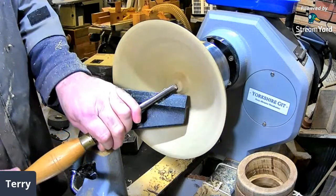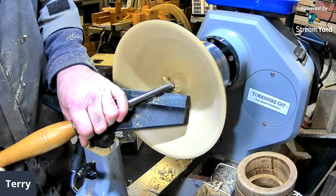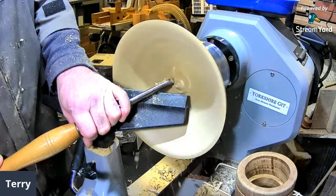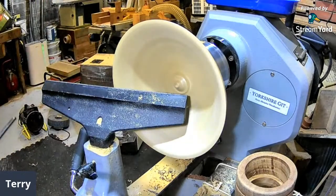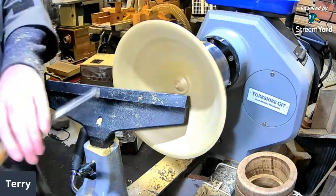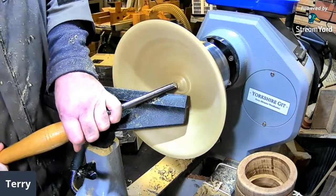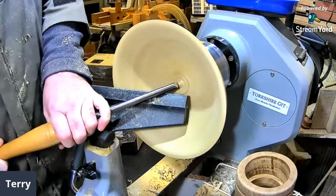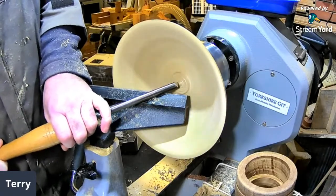Question: was the massive center lathe a Dean Smith and Grace Terry? I'm just trying to think now. It was about 100-foot long bed. The gap between the bed was about 14 or 15 inches, and the widths of each bed were about 1.5 each. A massive great thing. We had independent 4-jaw chucks as well as ordinary 3-jaw centering chucks and 4-jaw centering chucks, so off-center turning was a doddle.